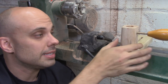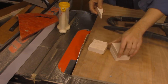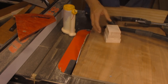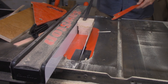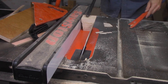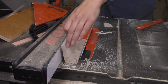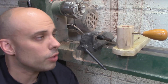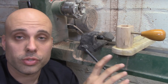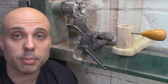For the central post, instead of using a long piece of maple with an end grain connection, I'm going to stack up some pieces of face grain maple so that I have the best glue joint possible — as wide as the banjo on the bottom. I use the table saw to shape it, ending up with something that has a nice pyramid shape — much more sculpted, with a wide base and way more wood, so it's just going to be a lot stronger. I also noticed that the tightening knob was totally in the wrong place and getting in the way of the tool rest all the time, so on the new one I swivel it around to the front corner, tap it, and put it in — and then my whole new assembly is ready to go.